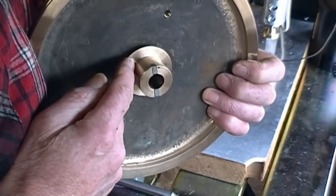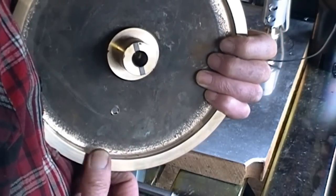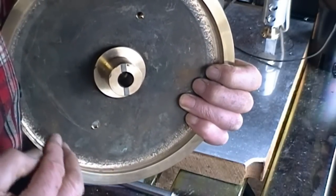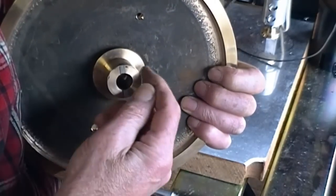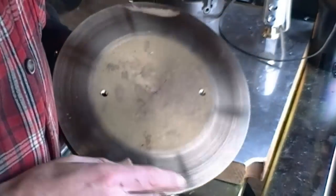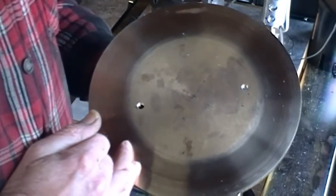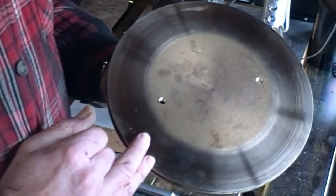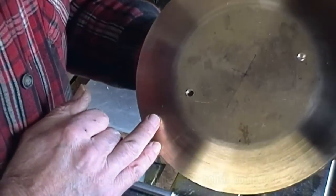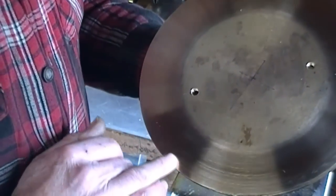Anyway, that's got to truth, which means it'll set up in the three-jaw fairly well, plus the shoulder on there. The outside has also been polished firstly with fine paper and then with polishing compound. Having done this side, this gives me two options for brush contact: this outer ring from underneath, the center boss maybe in a delta — a three-way sort of delta setup — and then on the top, which I'm still considering using as a contact surface.